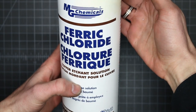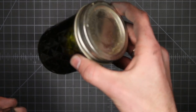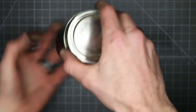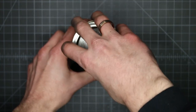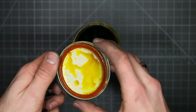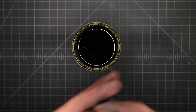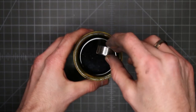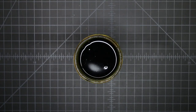To etch it, all we're doing is just using some ferric chloride. You can buy this on Amazon — there's a link in the description — and I've got a jar full of it here. Depending on how long you leave it in there is how deep the etch will be, so you can mess around with that. I like to do it for about 20 or 30 minutes, which leaves it still pretty shallow, but I like the look of it. So I'm going to put this in here and in 30 minutes I'll come back to take it out. You just drop it in and it's done.